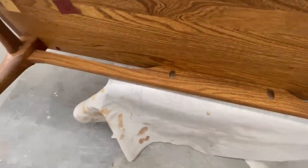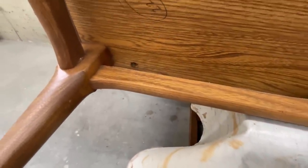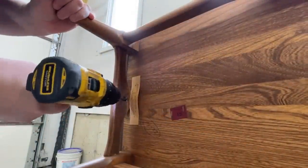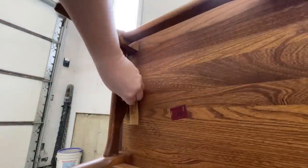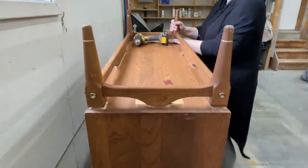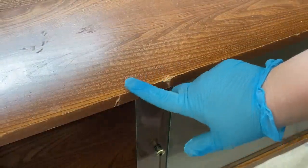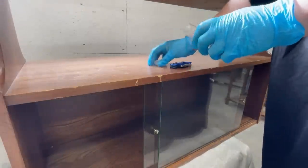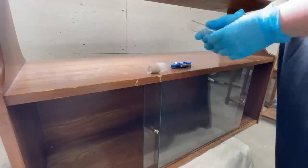I had a look at the base and the bottom of the cabinet. The base was held on with a few screws and there were a few more holding the bottom board, so I took the base off to see what was under there. In this tiny little gap, I could see that the sides and the bottom were all held together with dowels and glue. Since the unit is in such great condition, I didn't want to try and take it apart and risk damaging something, so I decided to just keep the doors in place and work around them.